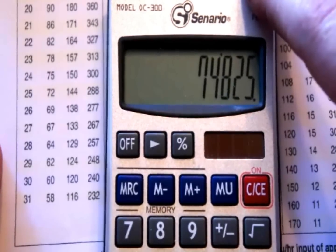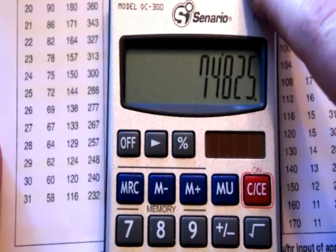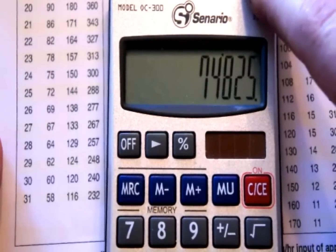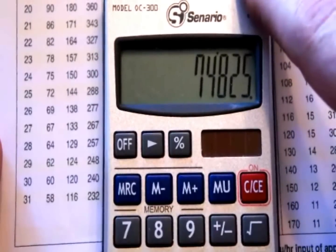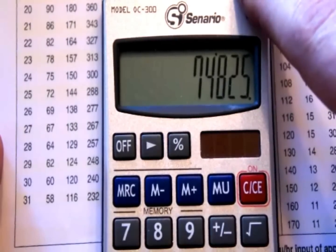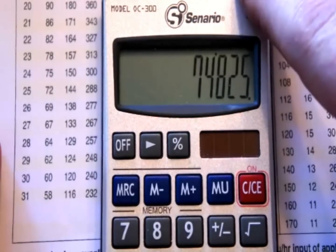The manufacturer says it's a 90,000 BTU input furnace and we're set at the manufacturer's pressure, but we're so far below the nominal input that if we didn't change orifices we'd just end up with higher than normal gas pressure. We're about 15,000 BTUs off, so we're going to go ahead and change the orifices, go back to the manufacturer's pressure, and see how close we get.